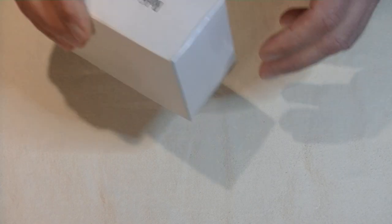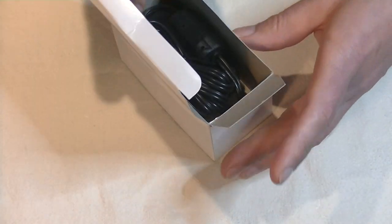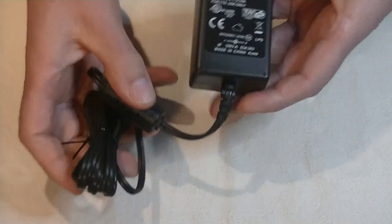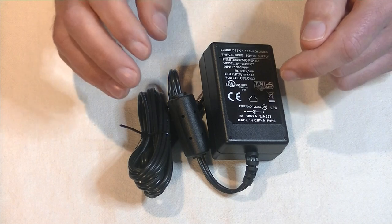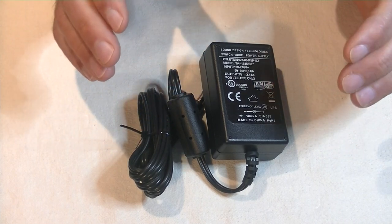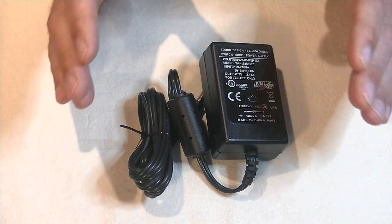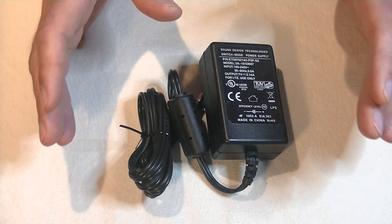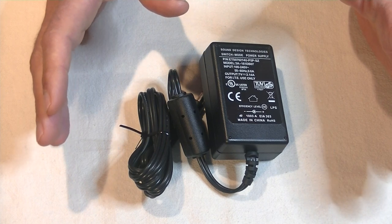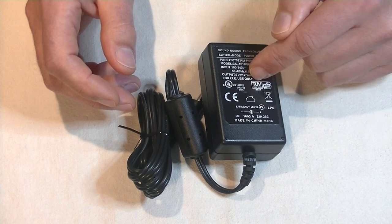The other thing I've been looking for a long time is a 6-volt switch-mode power supply. The 12V ones are very easy to find, but a 6V isn't. The thing with SMPSs is these power supplies tend to be noisy. A year and a half ago, I had about 25 different 12V units in and tested them all on the scope — almost all of them were noisy, with lots of spiky artifacts left over from switching from AC to DC.